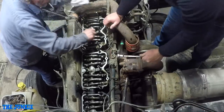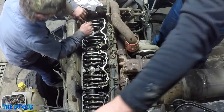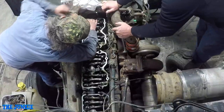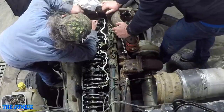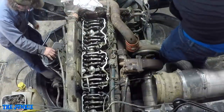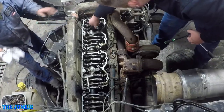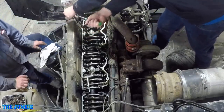Number one injector. Now you've got to be careful with this tool because it wants to snap back, so you've kind of got to hold the wrench, hold the socket, to keep it from kicking back. Because when it snaps it will loosen it back up. Alright, there's that one. Now we're going to run the other sequence - valves on one, injector on five. That sounds loose. That's a little loose.